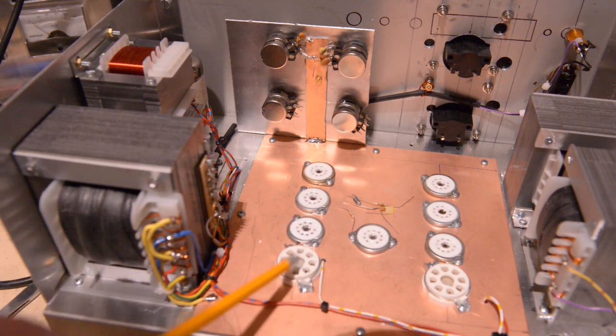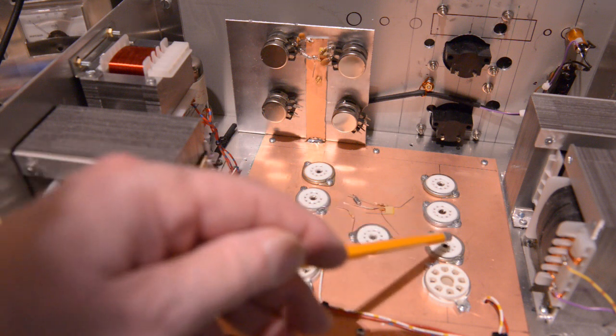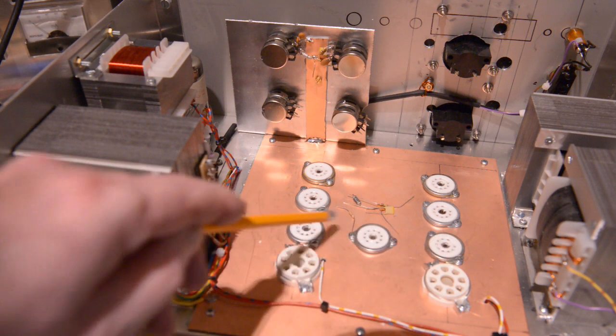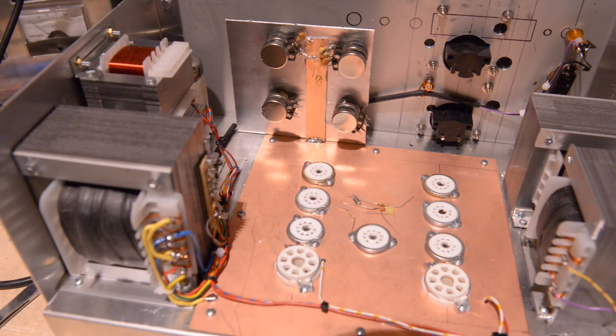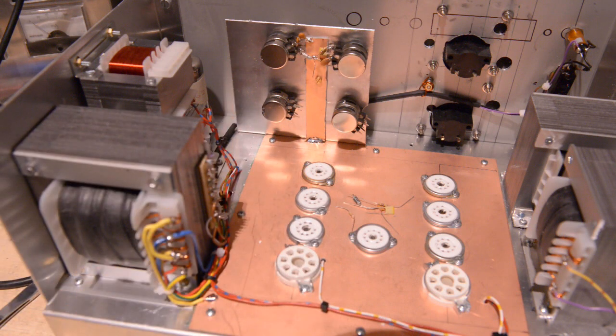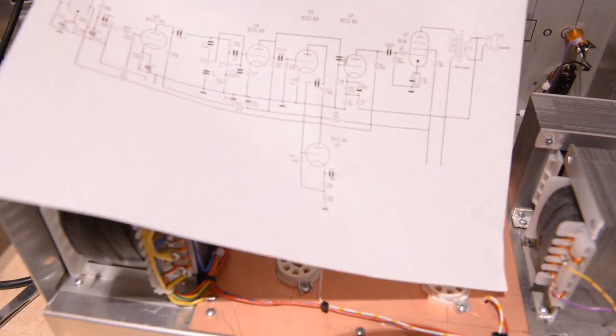end valves in, the two EL34s, and I pushed that valve in and that in, then they started to oscillate because you have a feedback from this side to that side and then vice versa. So that didn't work. So what I have done is both screen grids are going to the same point of that choke. I don't know if you heard of screen grid modulation. That is exactly what happened. So I can show you on the schematic and hopefully it will work.